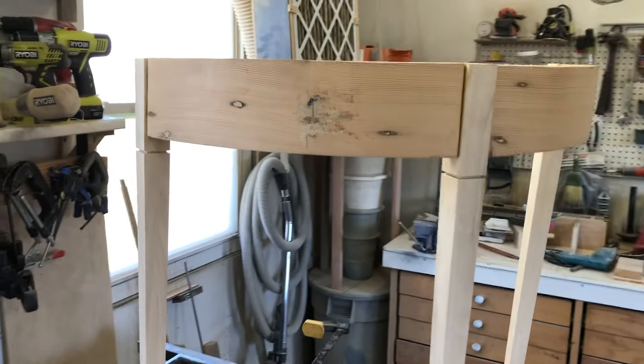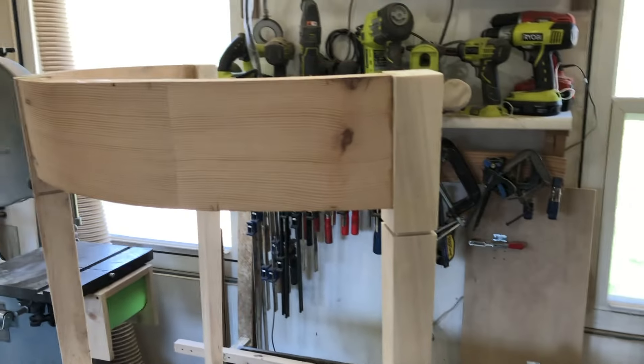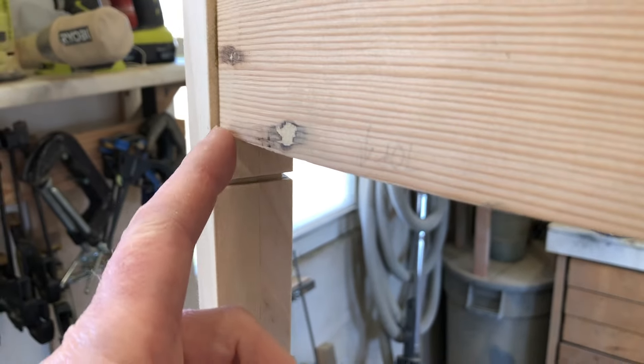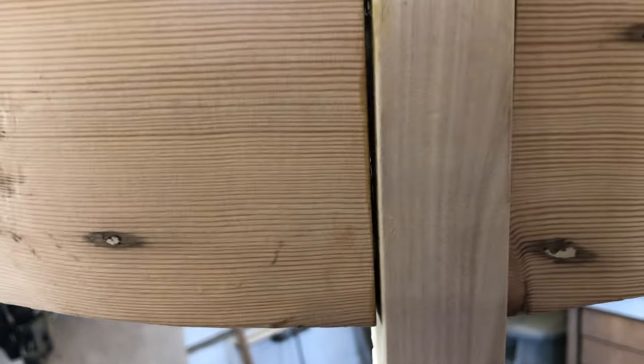Back from lunch. Taking the thing out of the clamps, and although I kind of like the overall look, I am not happy with this result and I'm going to wind up redoing a whole bunch of this. This particular joint looks reasonably good actually. This one is nice although we're slightly closer in here than up there, which means that the leg is on a bit of a twist. It's not bad, I could live with that. This one — not happy with it. It's significantly closer to the face of the leg at the bottom than at the top, and I'm not happy with the gap that I got left here. Just putting the pieces together, that just did not work.